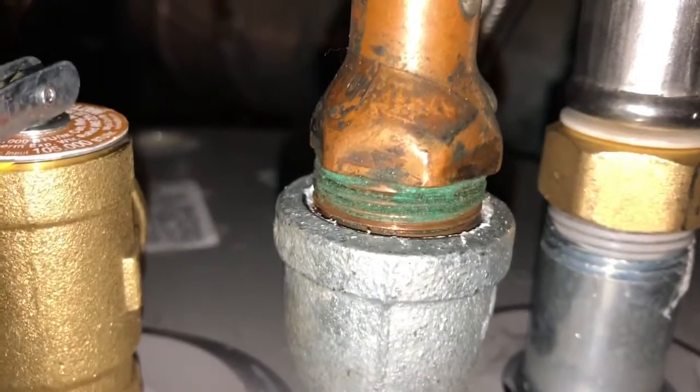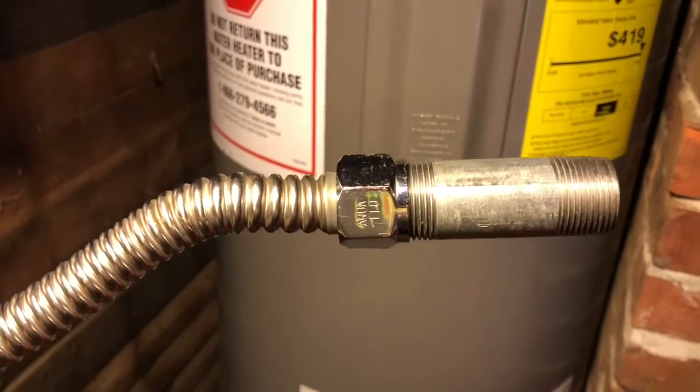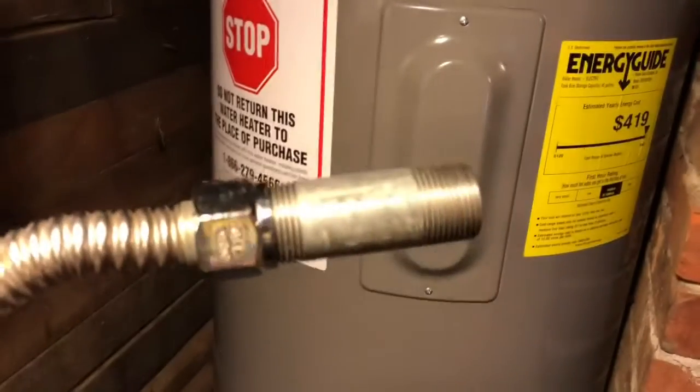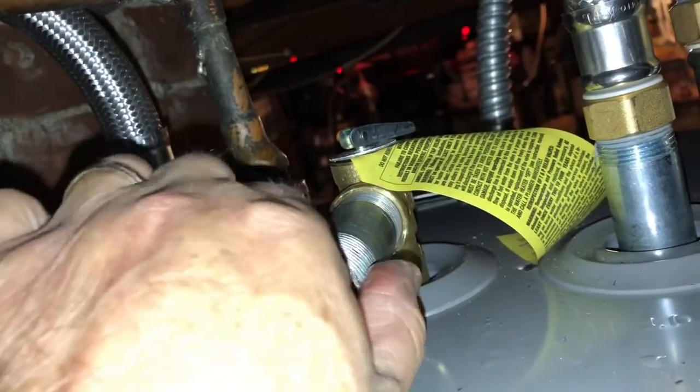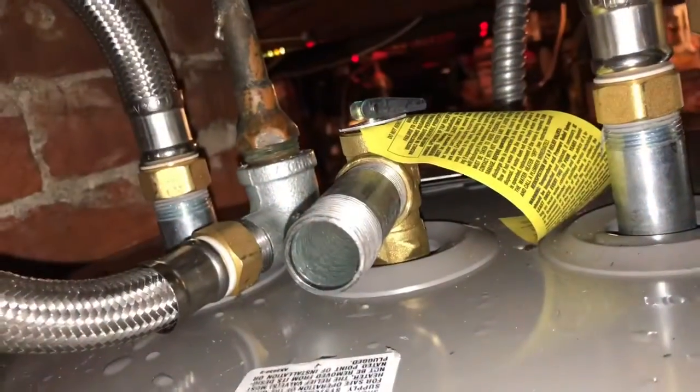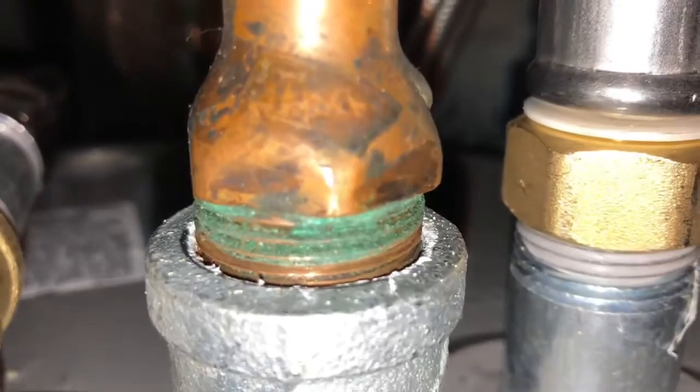I went and had dinner and came back and still no leaks. Yay, no leaks. And now I'm recycling some of my flexi hose from the old tank, and I'm going to use this for the pressure valve release. So this will go into a bucket. It'll tell me if it has too much pressure. It probably doesn't. Our water pressure here isn't very good. So, just saying. All right, so this part here just goes right into there. There's no pressure on this, so I don't have to worry about leaks. And then this part goes on there. And yeah, there is my pipe emptying into the bucket.